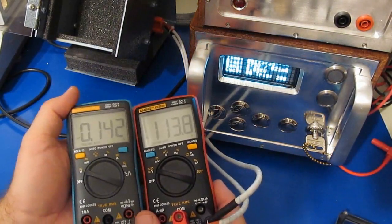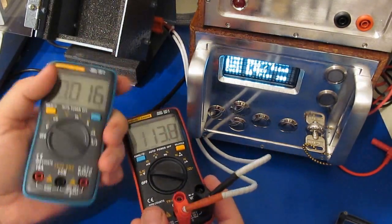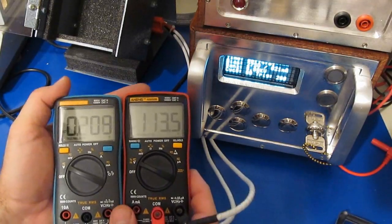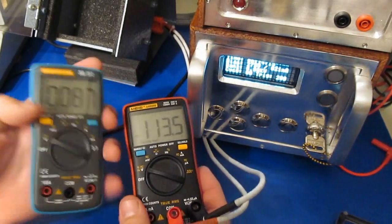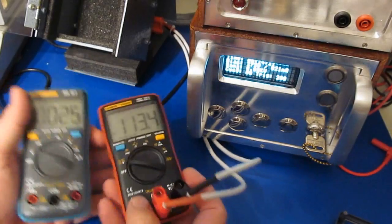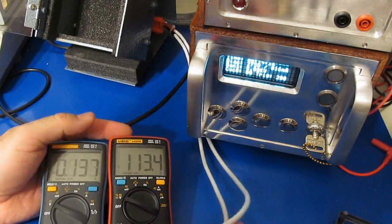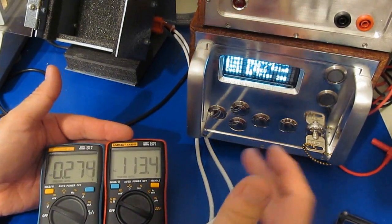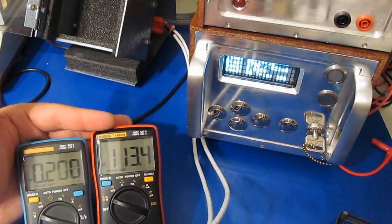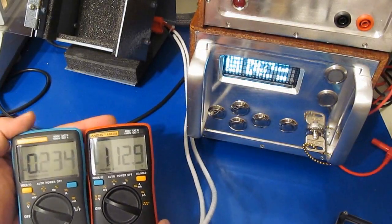I also saw the same problem again with the 860B. It does the same thing that this little 8002 does. And again, we've seen other issues where the meters don't auto range correctly. So that problem is not all that unusual, that you can kind of creep up on it. But I think these are the only two meters, this 8002 and that 860B, that actually had a problem where they couldn't handle this rectified AC signal coming off the generator. So that's pretty unusual. It's also fairly common that you would work on a switch mode power supply, the first thing you're going to do is rectify the signal coming in, and you go look at that with your meter, and it's probably not going to read correctly if you've got one of these meters. So yeah, just keep that in mind if you're buying one, that these do have a quirk like that.